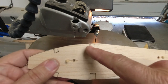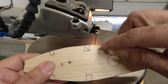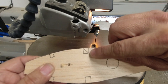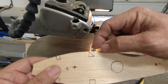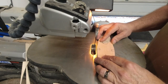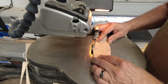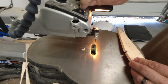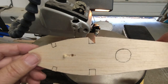Okay, so as you can see we got the first cut done from the upper top of where the spar is going to sit in this slot. The next cut we're going to make is we come down this side on the existing cut-down line mark that we've already drawn. We simply take the blade and follow that down to that corner, and this whole triangle is going to drop out.